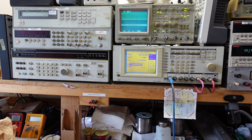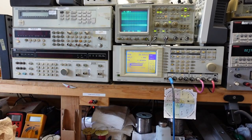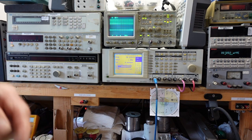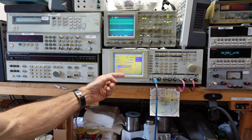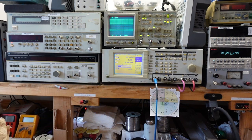So I'm going to have to check the offset. I'm going to have to go back and forth and do this a few times. I'm going to do that off camera. You don't need to hear me curse. Okay, so I went back and forth with this a few times. This is pretty much the best I can get it with reasonable offset and lowest distortion. This was supposed to be at 0.03. It's 0.034. This unit is not calibrated. I'm going to call that good.